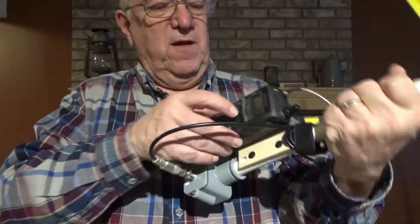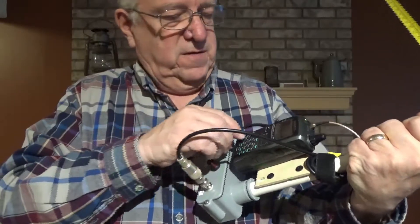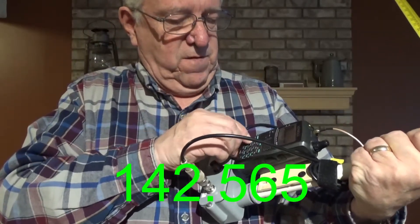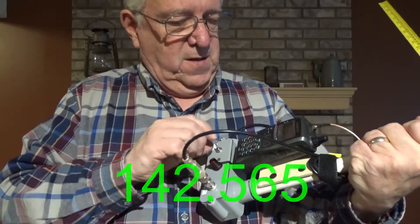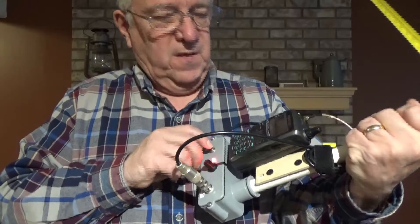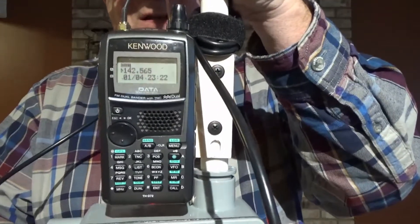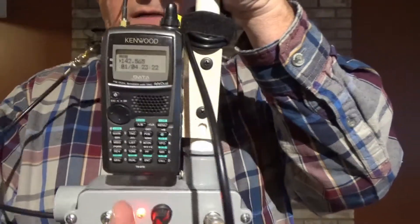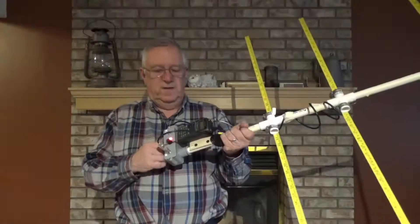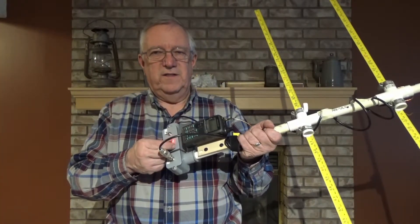What I can do is set my radio to 4 MHz off the desired frequency — 142.565. Then I turn on my offset attenuator. You can see that I'm receiving the signal, but now I have the ability to turn the level down. I've turned the level down on my attenuator until the signal cuts out.